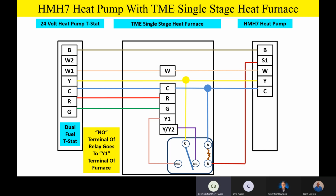Okay. Have you guys checked for any rebates in your market for heat pumps? So there are rebates. I actually have a note of my things to do. One of them was to call Kansas City Power and Light or Evergy and find out what the rebate plan was for the area, because I used to know it when I was a contractor, but I'm not up to speed on what the current plan is now. Okay. Yeah, because we can get some really high levels of efficiency out of these units with variable speed products. Yeah. So I think it's somewhere between $500 and $600 for a 3-ton that's coming in 16 SEER or north of that. That's huge. That's nice.